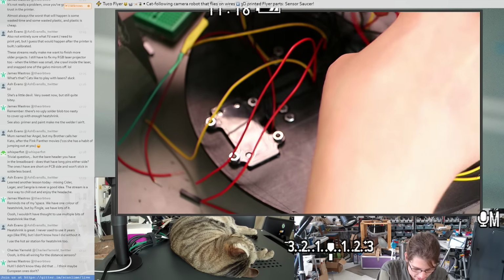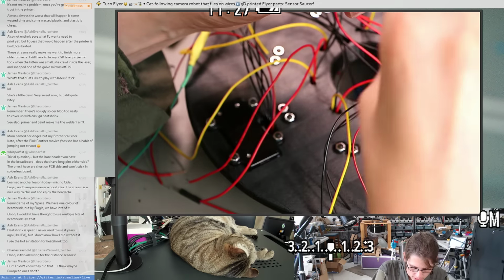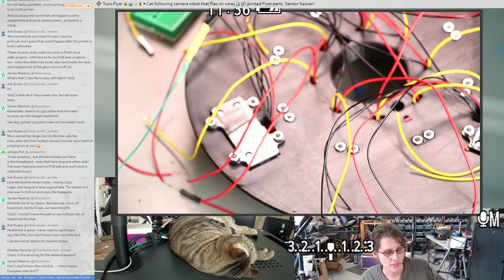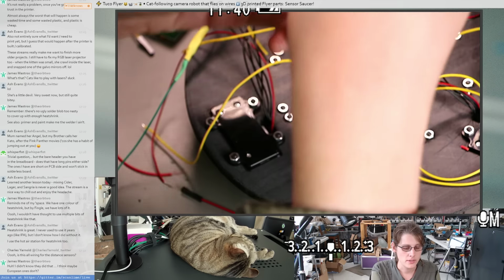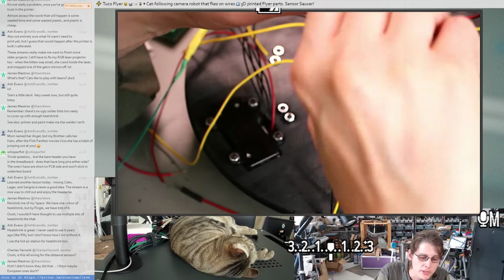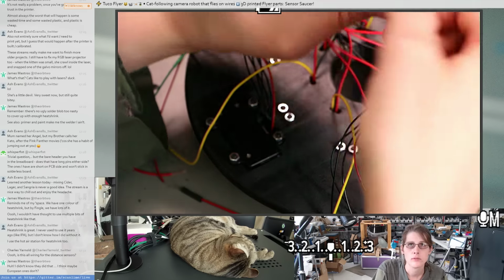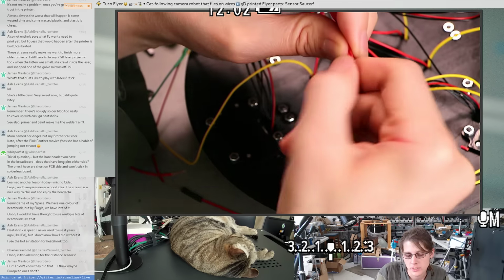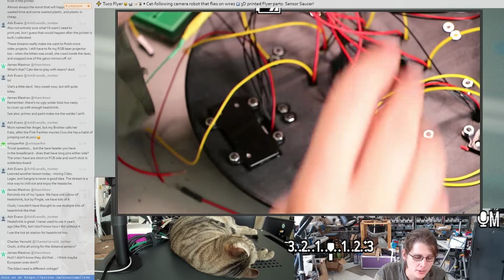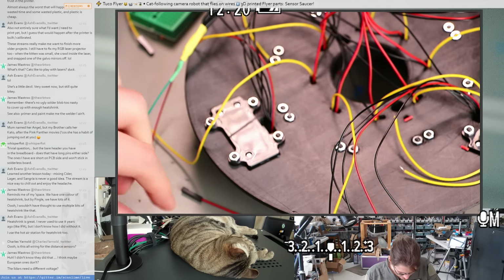And then Chris, I think, was asking if this is the wiring for the distance sensors. Yep, these are the analog Sharp distance sensors, the ones that take 5 volts in and give you kind of a sorted distance-related analog value out. They're mostly being used to see if something is about to hit the gimbal, so that we can avoid that. And then the 3 sensors are LiDARs, which will be partially useful for collision avoidance, but mostly are there for determining how far away the floor is for setting the height. And there are 3 of them, mostly so that there can be some redundancy, because the floor is going to be full of weirdly shaped objects, and so you can assume that whichever one is furthest away is probably a good approximation of the floor, while also correcting for the tilt of the entire robot.